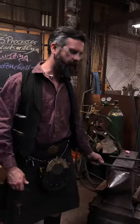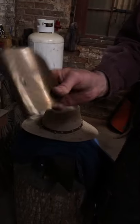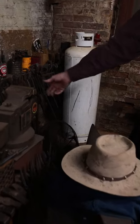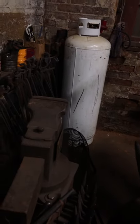If you're using a modern vise, soften up the jaws. A lot of them have heavy knurling on them — either soften them up or make yourself a pair of jaw covers. I made these out of just a piece of bronze I had left over. They just go on there and protect the work from being marred. It's better that it mars the jaw covers than anything. Or remove the jaws that are on there and put some mild steel ones on — it'll make a difference.